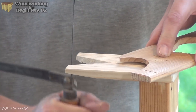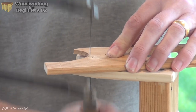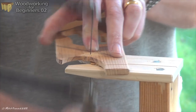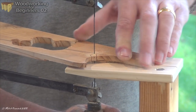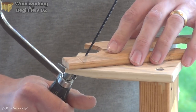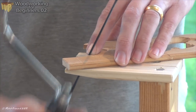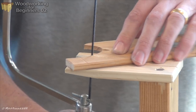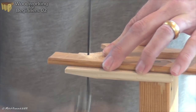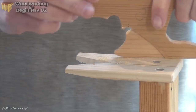Cutting is just moving the saw up and down vertically and you move the work piece in the direction you want to cut. You can see with the fret saw how tight a radius we can actually cut. With the coping saw it's exactly the same thing, but because it's a bit coarser blade, getting it started is a little bit trickier — so a light touch, maybe start at an angle, then bring it nice and perpendicular. You can't get quite as tight a radius with the coping saw as you can with the fret saw, but it's good enough for a large jigsaw puzzle.